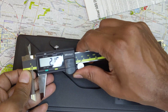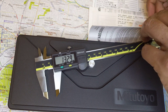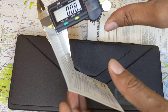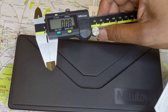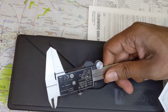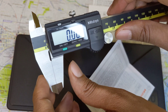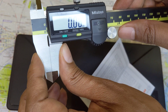As you open it up, you want to be sure that if you put a piece of paper in between — let's try it with the certificate — this should be about 0.07 millimeters. Yes, it's 0.08 millimeters. Pull it out and you should be able to see a gap that's crisp and clear between the calipers. The level of fit and finish on a real Mitutoyo caliper is of a very high standard, and if you see anything in that gap that's missing or any bends in the caliper, you know something is wrong.